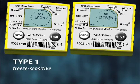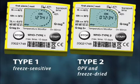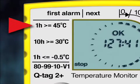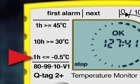There are three alarm conditions set for the devices. Since Type 1 devices are for freeze-sensitive vaccines and Type 2 devices are for OPV and freeze-dried vaccines, the alarm settings for these two types are different. In Type 1, the 45°C alarm is a single alarm activated if the package is exposed to temperatures over 45°C for at least one hour continuously. The 30°C alarm is activated when temperatures are above 30°C for at least 10 hours cumulatively. The -0.5°C alarm is activated when exposure to temperatures lower than -0.5°C occurs for more than one hour continuously.